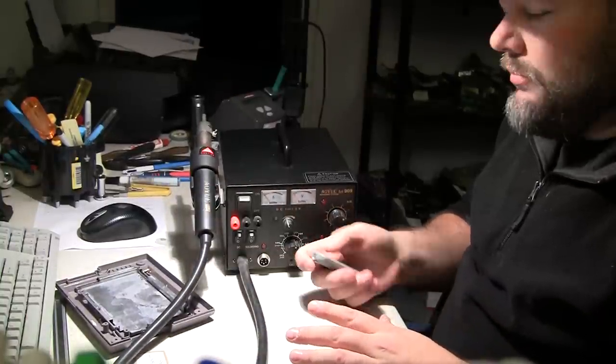I'm going to clean the top shell, dry it off, and then give this a warm. Let's see if I can get a real good close up of this going on. There's no real trick to it other than stop when you see it go away. If it's dirty, it's probably just going to accentuate it worse. I think I've done one where I tinted it and it just made it worse. There you go — that's about as good as it's going to get. Any more than that and it'll just make it worse. Now it looks more like a scratch than a crack. There you have it.